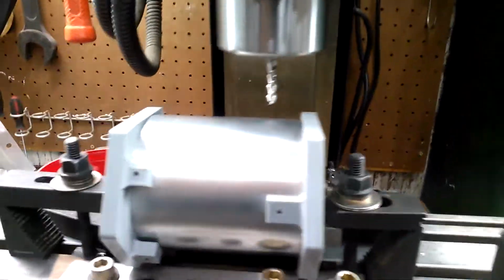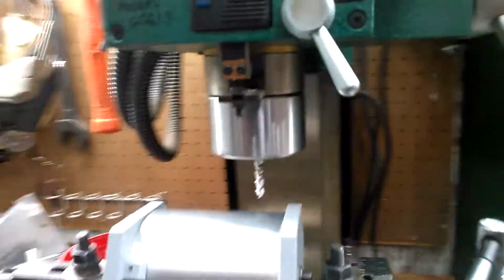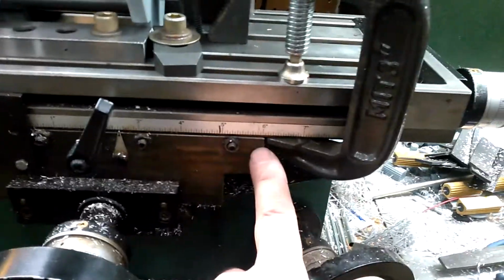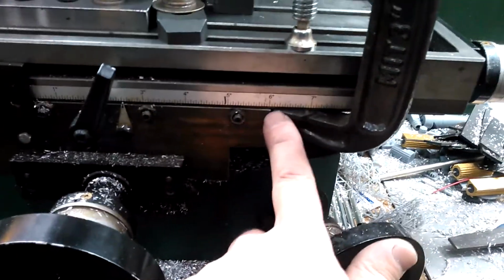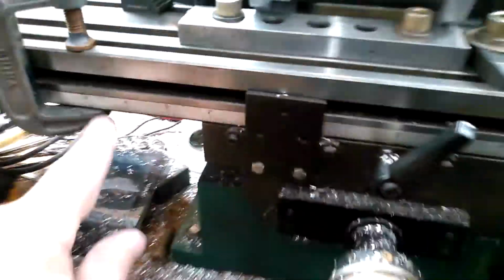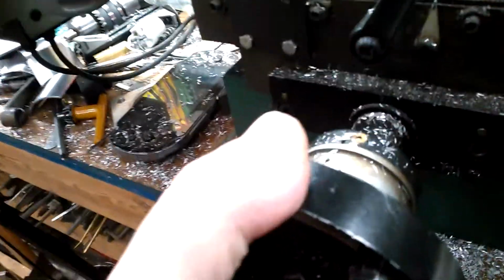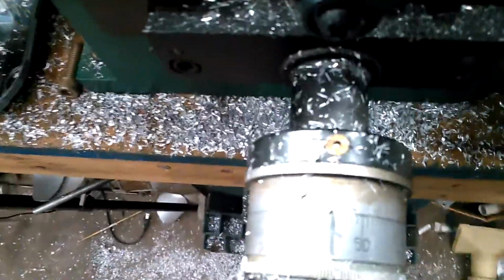Okay. So I already have this set up. I have things marked out. I have some arrows on here to let me know, visually, okay, I'm getting close to my end stop, and then I go to here. And same thing on this side. This is my length of travel set point. Also down here on this, I have an arrow penciled in 55 thousandths.